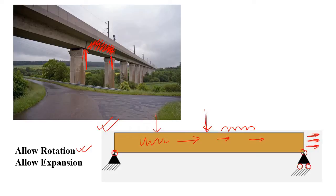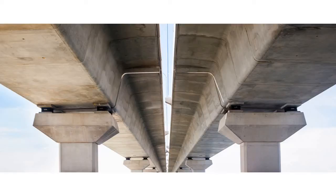The roller facilitates movement in the horizontal direction. This is the function of the simply supported beam, and as a result of these two facilities the stresses within the beam are also reduced. To allow rotation as well as to allow thermal expansion, we have to put some instrument in between the deck and the pier.